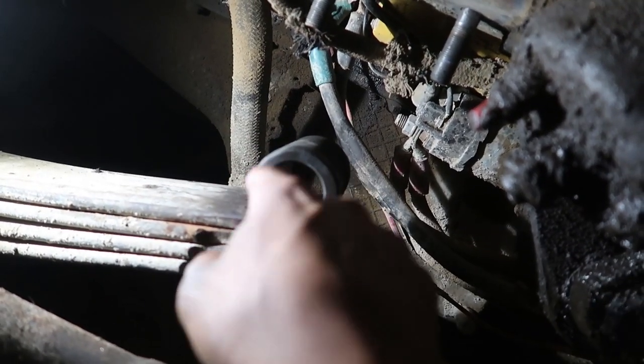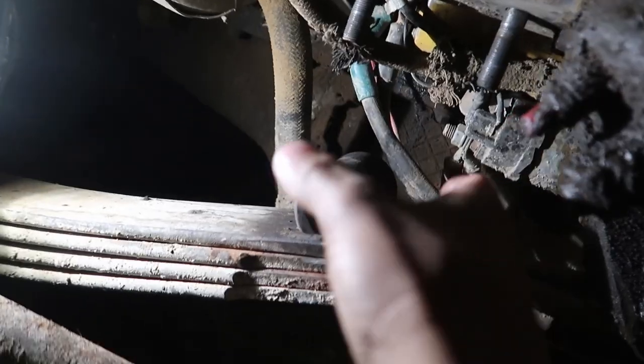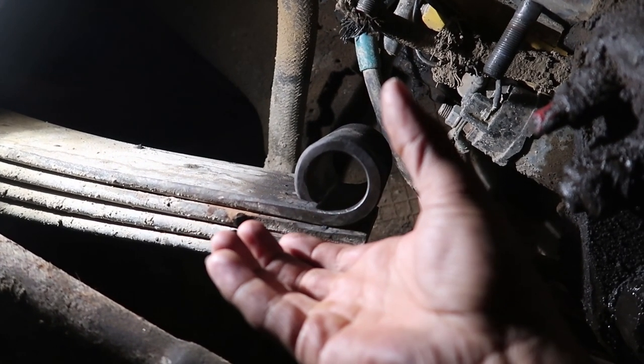What I'm going to do now is heat it and try to get it red. I know leaf spring material is really strong, so I'll heat it as much as I can so it expands. What I did with the new bushing was throw it in the freezer — yes, I went inside and put it in the freezer — so it'll shrink a little bit. As I heat the housing and shrink the bushing, the metal should work against each other: this expands, that one shrinks. I'm going to hit it with a mallet so I don't bend it — the sledge would just mess it up. Then I had another idea: a bearing press kit. I did not think of that until right now. We probably couldn't pull the old bushing out with it, but we can press the new one in, kind of like a bearing — it should compress flush.